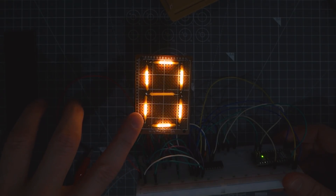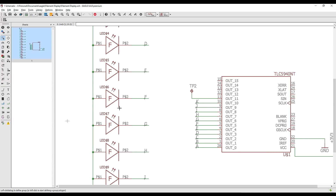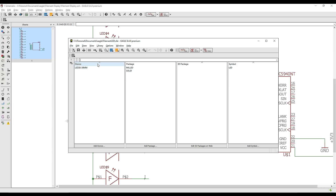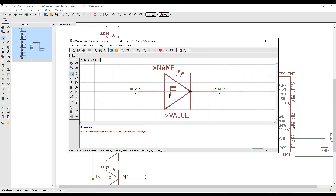That's it on a breadboard doing some counting using the TLC5940 — it's not doing any PWM dimming yet, I haven't programmed that in. Let's take a look at Eagle. Here's my current board layout — let's skip out of that quickly. Here is my schematic. These are the little filament LEDs. I haven't really done this for a while — creating a footprint and a symbol — so you'll have to make do with my bodge job.